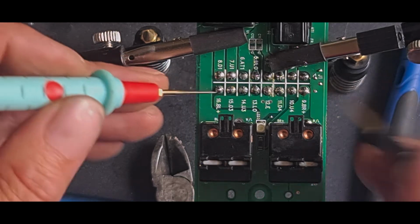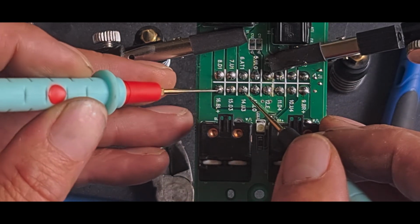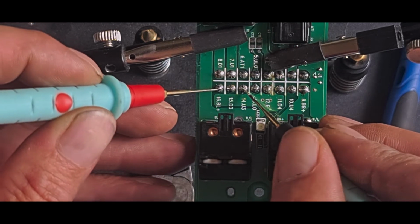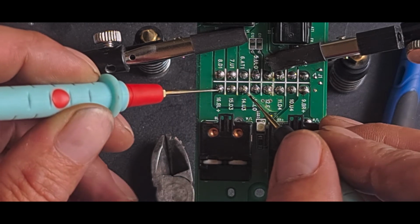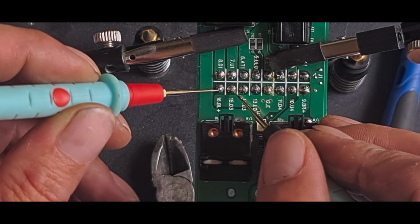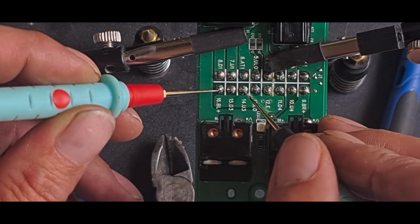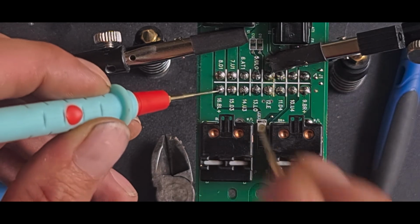So when I tested it, the car, what I did is I took that, I shorted that out with my meter to that one on amps, 20 amp, and then what I did is I took an earth from there and shorted it out to there, and the window went down or up. And then I did the opposite, I did this to there, and then I shorted out from there to there, and the window went up. That was on the wiring loom in the door.